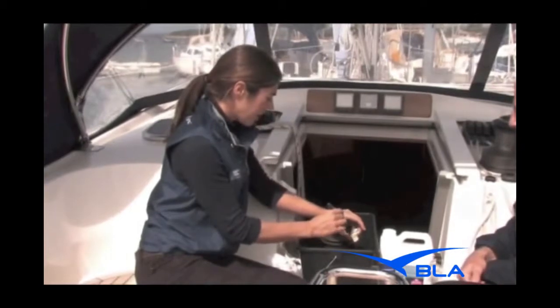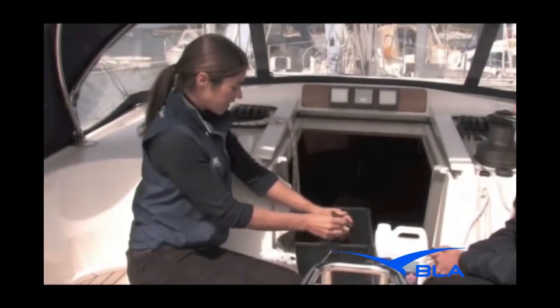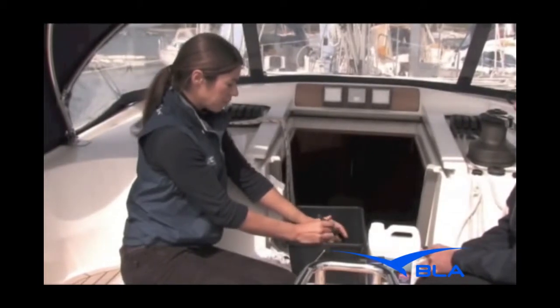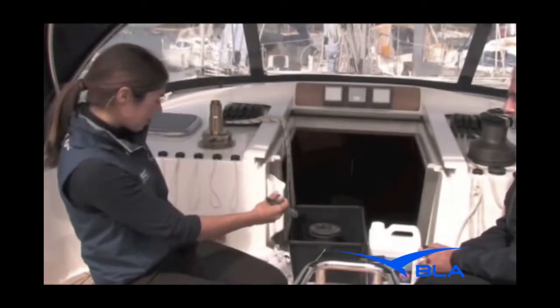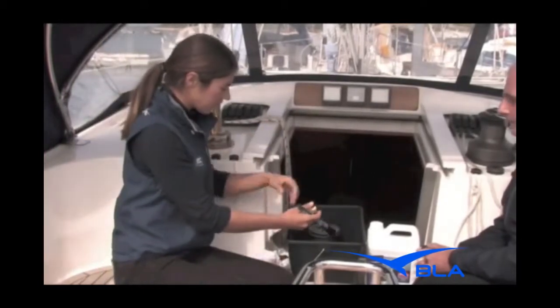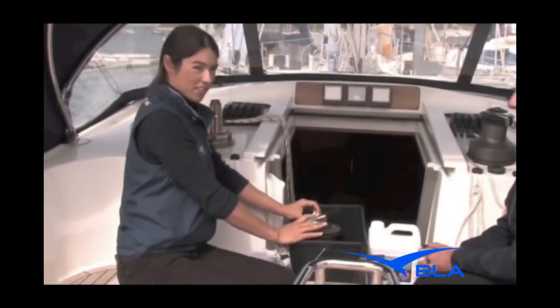So I'm just sort of flicking in here. One thing to note from experience is that when you're brushing, do it deep in the bucket because little bits of grease are dark and they will stain on the teak. Note that we've put some plastic down and we've got tissue paper to hand, so we're preserving the boat as well as servicing the winch.